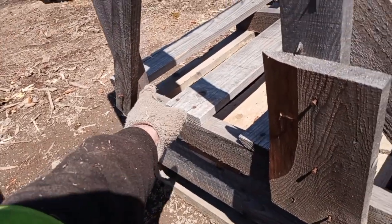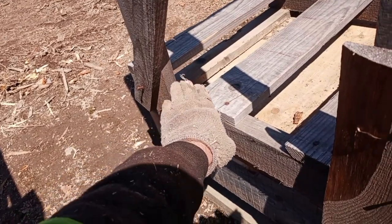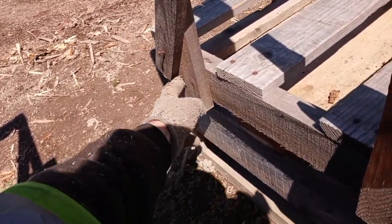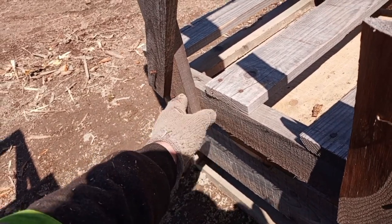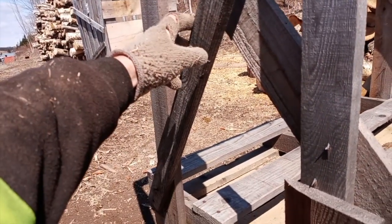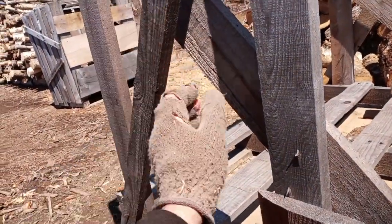On this one the upright failed eventually, so I pulled in a proper-length one. Basically it's 36 inches from here up, and the base piece is about four or five inches — there's no specific length, I just want them long enough to get two nails in. Four inches is plenty, so a 40-inch upright is sufficient. Cross pieces are scrap wood again and can be any length. You do want to crisscross them because the crate will rack easily in one direction, so crisscrossing helps.